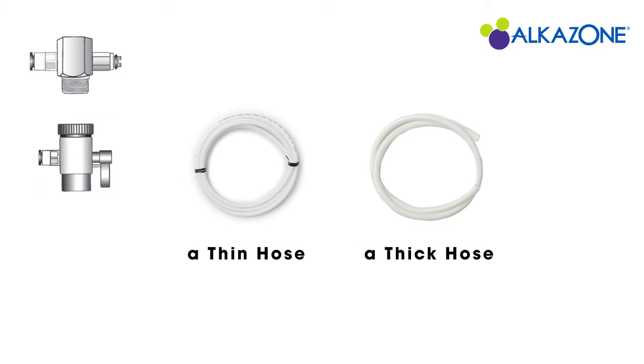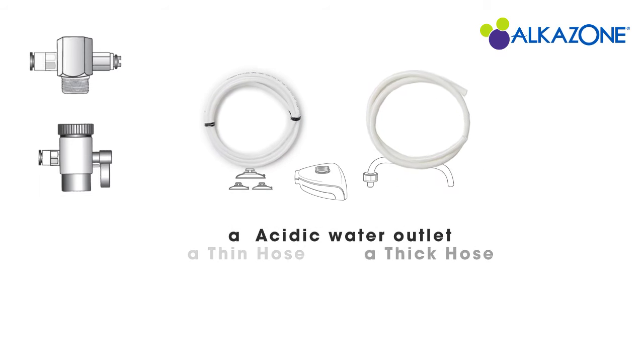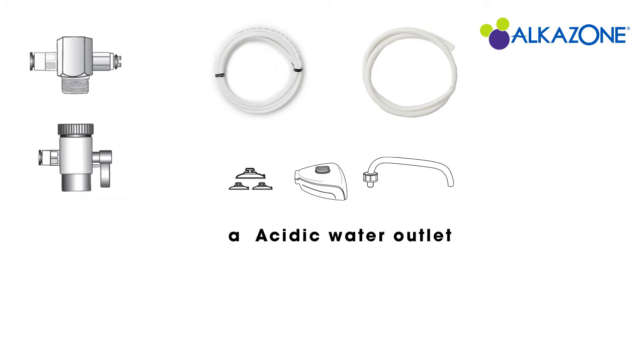Next, let's look at the water hoses. There are two sizes included, one thick and one thin. The thinner one will be connecting the ionizer to the running water line connection adapter, or to the diverter that we just looked at. The thicker one will be our acidic water output hose that will take the acid water from the ionizer to the sink. Also included is an acidic water outlet that will help to neatly mount the hose on your sink.